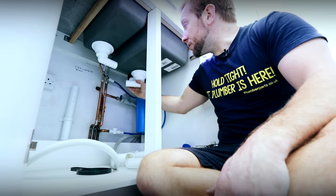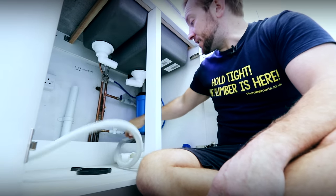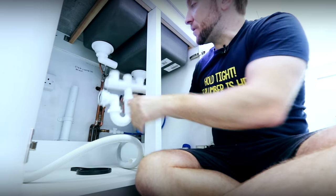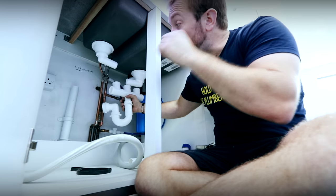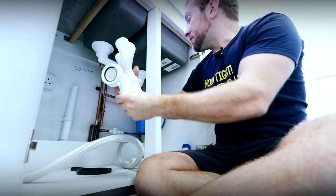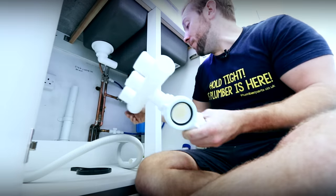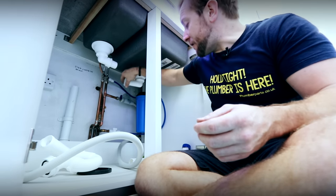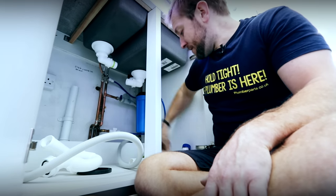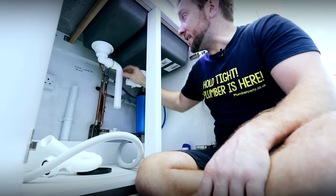We can see that we've got our two wastes here, and we also know that we've got our big extension hose for the waste from our dishwasher next door. So number one, I know that my main outlet to this beast over here wants to point that way. What I also like to do is keep the waste away from the front of the cupboard - I don't want it running over here because I want the customer to be able to use the cupboard. We've tried to keep all our pipe to the back so it's nice and out of the way. We're getting rid of pieces we know we're going to need - a nut and a small little compression o-ring on there to make these work.